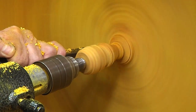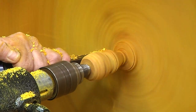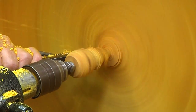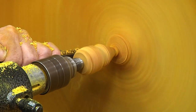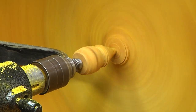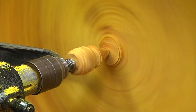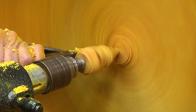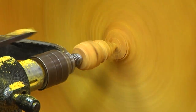I'm sneaking up using my skew as a negative rake here, just trying to make a pinpoint because I've got to snap this off. I don't want it to snap off into the bottom of the bowl, so I'm leaving a little bit proud. I'm going to slow the speed down now because I don't want any wobbling. We were at 180 RPM most of the time and got up to 300 recently, but that was about it. There we go — now we're smooth.